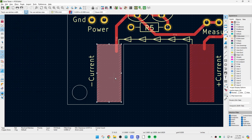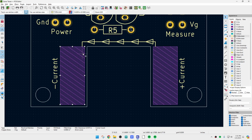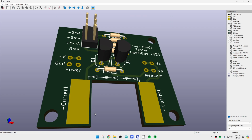All right. Once I have them on there, though, they're going to be covered with solder mask. So it's really, really important that you uncover them. Otherwise, they're going to be buried with a solder mask over them. So what we need to do there is we need to go to your layers over here on the right and look at your top layer solder mask. And here I've drawn a rectangle, a filled rectangle, for the solder mask on the top. So it's going to expose these two areas. Whatever you draw in here will be exposed. It does a mirror or reverse image of the things when it does its plotting at the PC board factory level. So without those two things, they wouldn't be exposed. And you can see them here in the viewer. They definitely are exposed now. Okay.